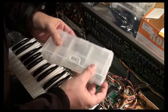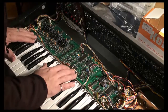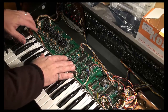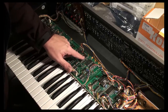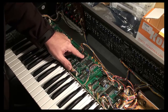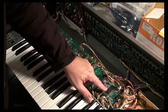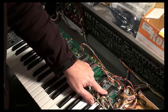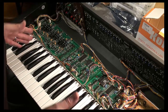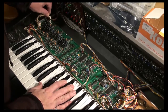Now these voices have been socketed. They're all out now and we need to remove this voice board in order to remove this IC here, which is of course the controller chip for the voices — the voice assigner. It's basically little buddy to the big guy over here on the main CPU board. So let's take out the voice board first. I'm going to unplug this.